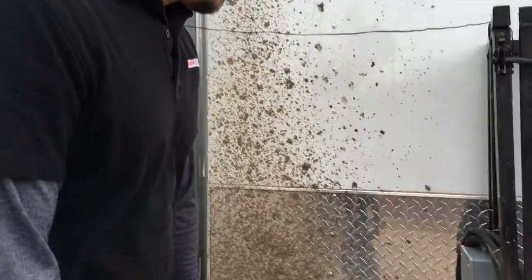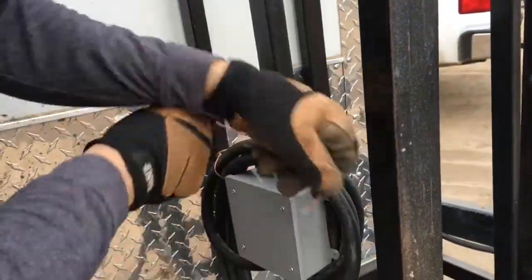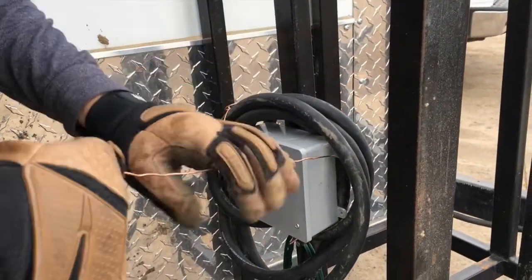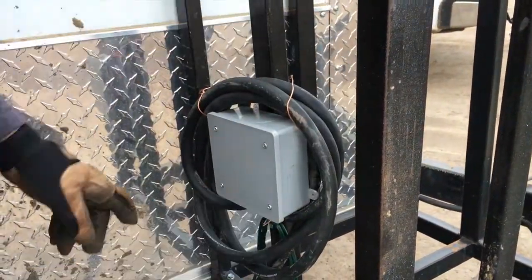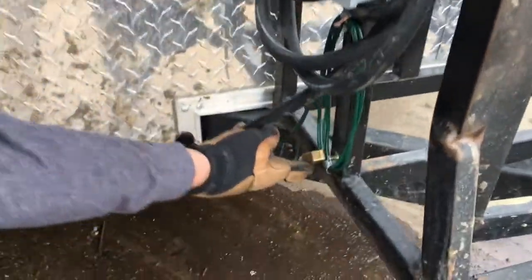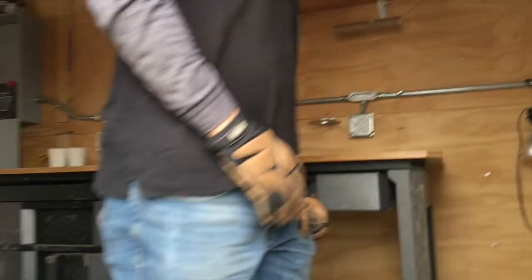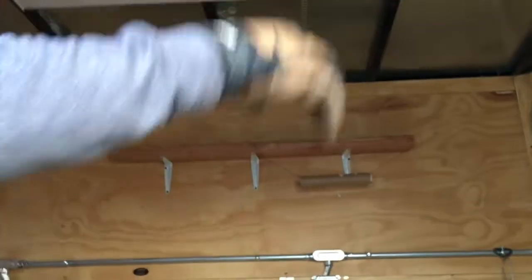I want to show you what we did. This bottom line right here will come off — this is just so as they travel down the road the SO cord will be able to come down and off. They're gonna plug it into their generator. The ends are right here inside of this PVC box, just so it doesn't get wet. This right here would just be their ground, so they'll undo this ground and strap it and then drive a little ground rod right there for the generator. I went ahead and sanded that and put it to steel for a lug.